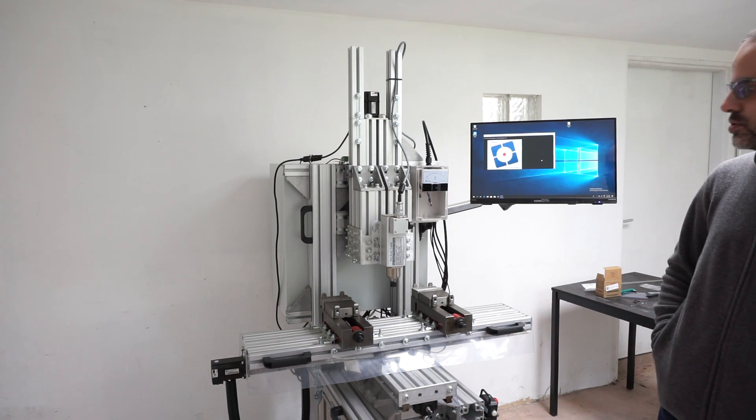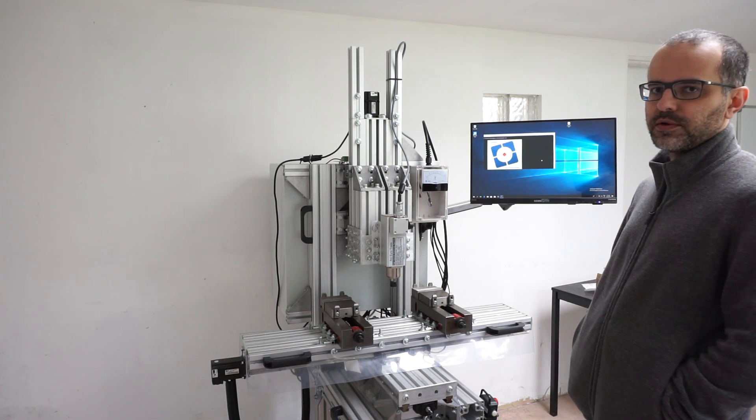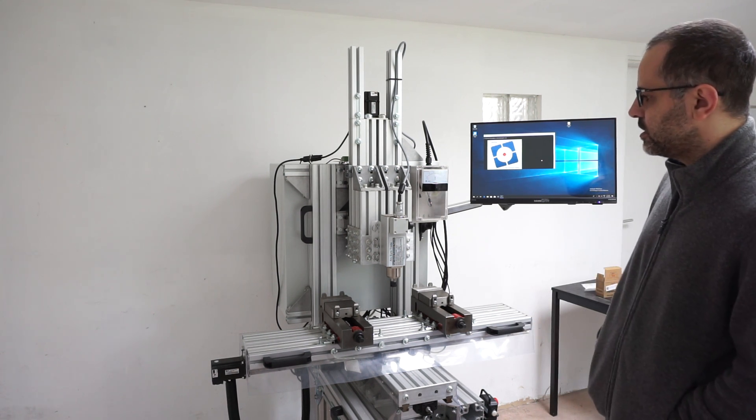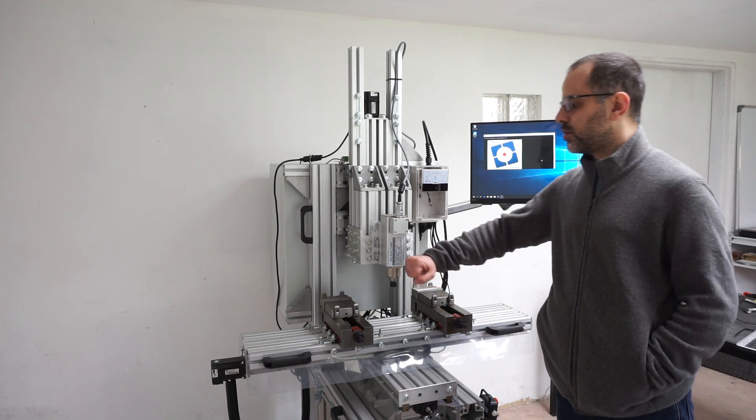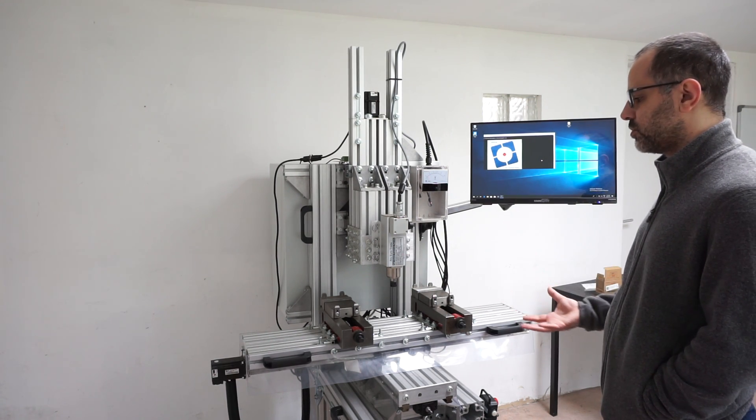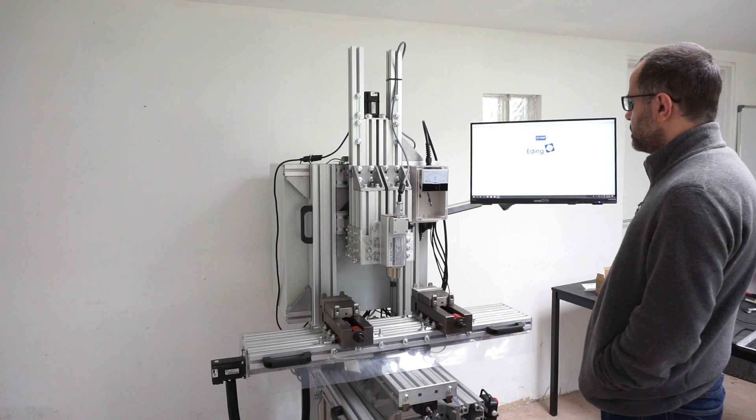While it keeps starting up — this voltmeter is actually a spindle power meter. It's connected to the VFD, which is inside the electrical cabinet, and it shows in real time how much power the spindle draws, which is very nice because it tells you your cutting power and if you're going in too deep or too hard.